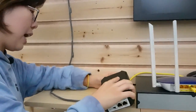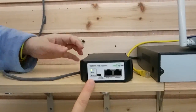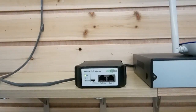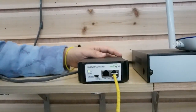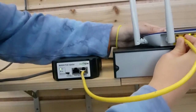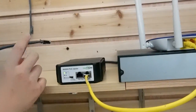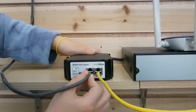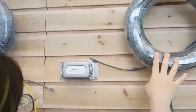Now let's connect everything together. I'm going to power it up first. You can see the power light is already on. We have the data-in port and PoE output. First, we need to connect it with our router using the data-in port. Make sure you plug in the right one with the router. And for the PoE output, we are going to connect it with our ethernet cable and connect to our PoE extender. This side is all done. We have a 328-foot cable over here.